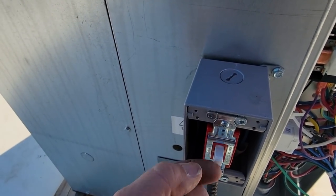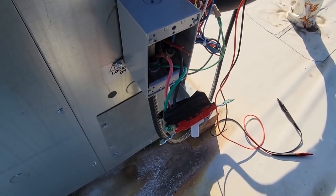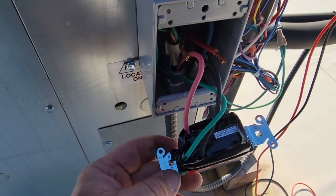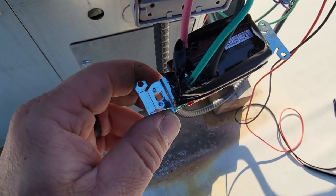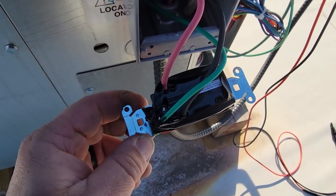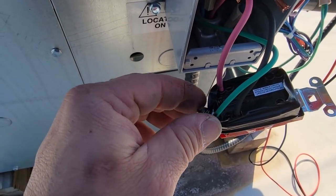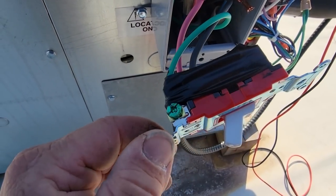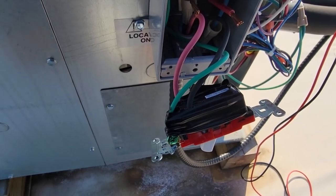It's got a really nice click one direction, but that's an issue — it's getting pulled. So I'm pulling the switch out, and the two wires pop out of the back of it because they must not have gotten tightened down. These Hubbell switches — they ain't stab-in-the-back like those junk ones for home receptacles. But yeah, when two of them pull out like that, that's kind of bad. Not impressed at all. So it's getting bypassed and they're ordering a new switch.